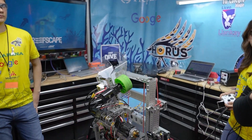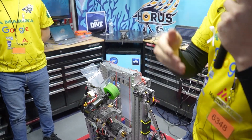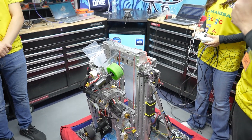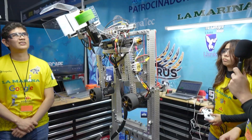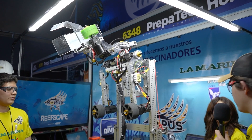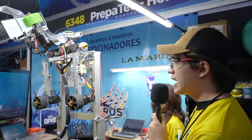Our driver has two modes to move the elevator. We know that the basics in this competition is precision, so maybe the presets aren't working as we need. So the driver can make a slight adjustment to secure the coral placement. Now I'm going to show you the presets that we have. L4 — this one is the preset for L4. It elevates and the driver can move the coral intake to secure the point. We also have the feeder preset.